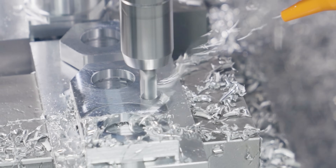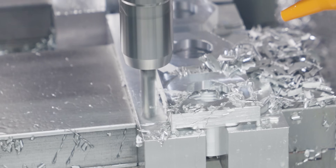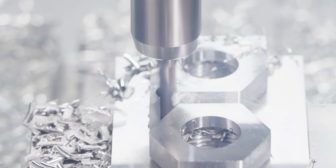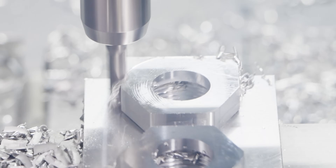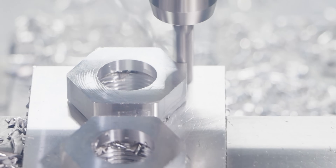The reason the feed rate is slowed down a little bit on this tool pass is because as it releases from all the parts, the part on the right-hand side may rotate if you're roughing it a little too hard. So we slowed down the feed rate a little bit on that one.